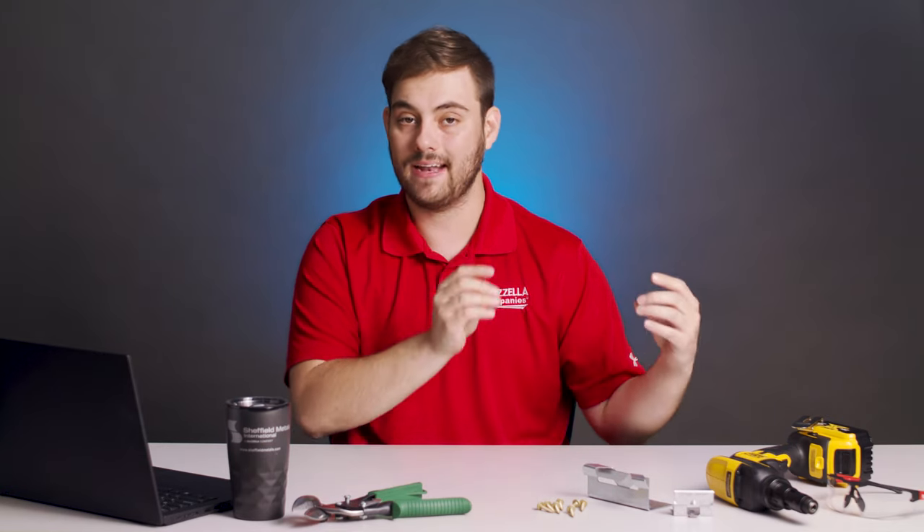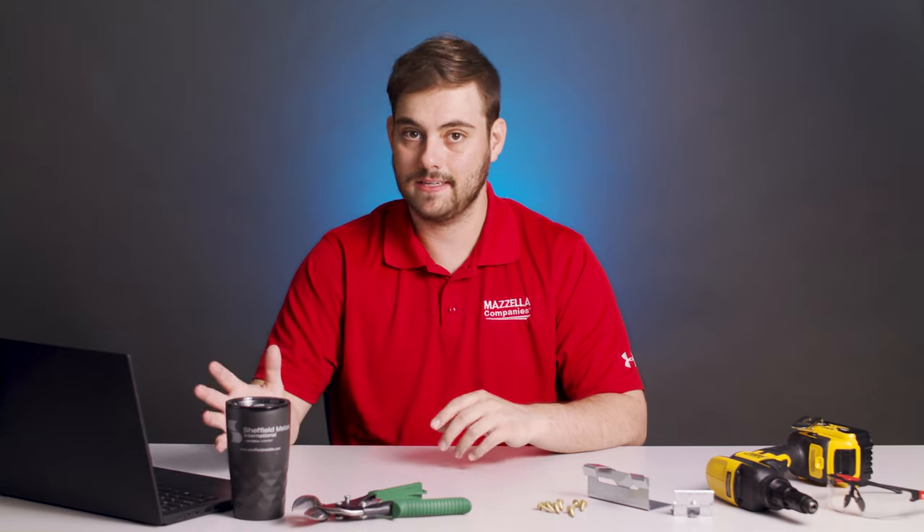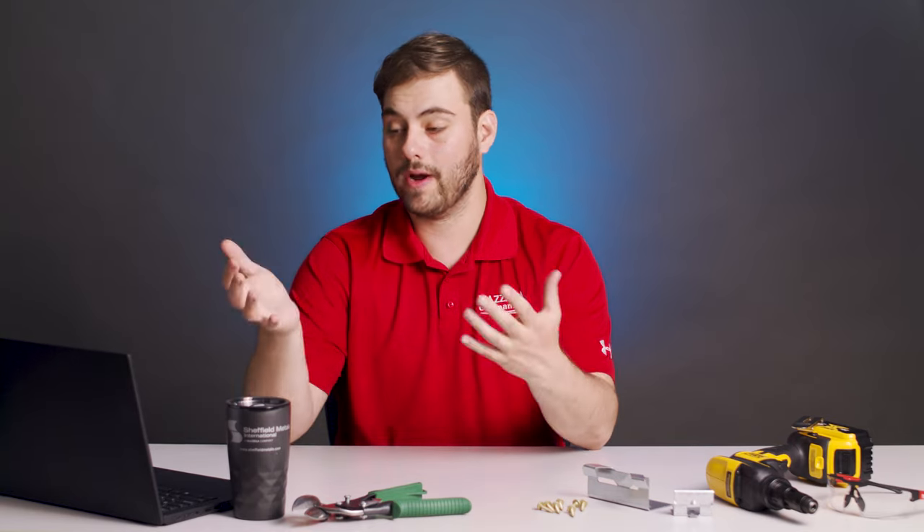When it comes to the metal substrate itself — what the metal actually is — you're going to want to use aluminum if you're within 1,500 feet of a coastline, because a coated steel like galvalume or galvanized will not stand up to that saltwater environment and will rust out prematurely. The other part of my answer is the paint system. You want a PVDF paint system — it's a high quality architectural coating that will help protect your roof, and it has great resistance to chalking and fading in that saltwater environment especially.